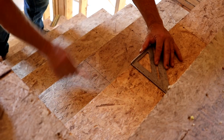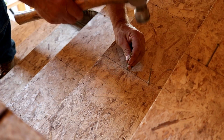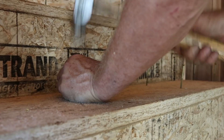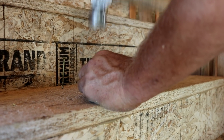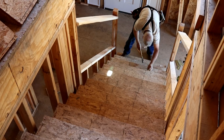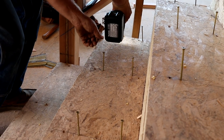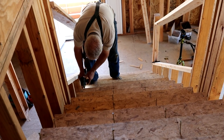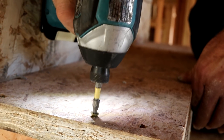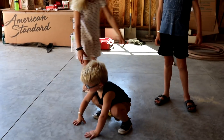I've let a couple of days go by since I put these in place and threw the nails in with the glue, so by the time I come back to screw them down today the glue is good and hard and doing its job. This way the screws lock everything down in place without compressing the glue or changing the height or flatness of the tread, even if there is perhaps one uneven cut. I'm using a 3-inch deck screw — the same ones we use to hold down all the subfloor. Nails are much more likely to squeak than screws, and a squeaky step, while not uncommon, is still an annoyance.